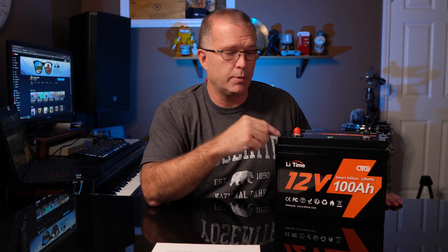As you saw, the BMS performs as advertised. You can absolutely run this thing continuously at its max rated output of 100 amps and 1,280 watts. In fact, you can exceed that a little bit and it'll still allow you to run for a pretty significant period of time. But if you exceed up to around 1,400–1,500 watts and around 120 amps, this thing will only give you maybe eight seconds max before it cuts off and stops discharging until the load is withdrawn. It will automatically recover and continue normal operation once the overload condition is cleared — no resetting required.